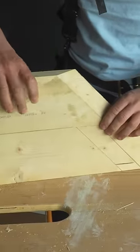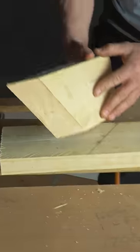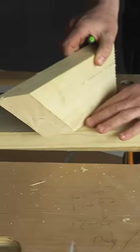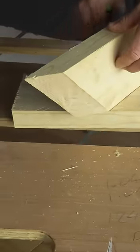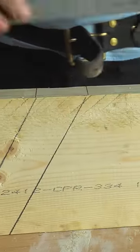This piece of timber is the same thickness as the hip or the jack rafter. This is the pitch of our plumb cut down there, and this has got to be the same thickness there, so we do another line there. Then when we square them across — one there, one there — and you join them up.